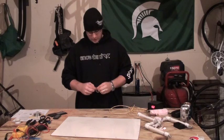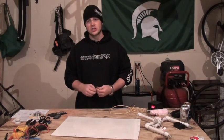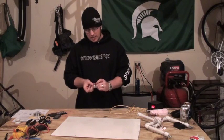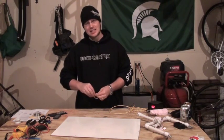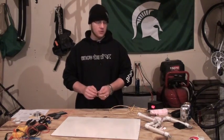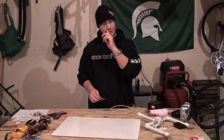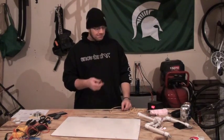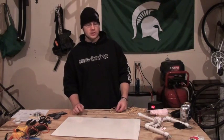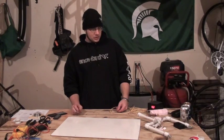If you don't want that big thing dangling, find some wire that's actually coated. Most of the coated stuff I found was like 18 or 19 gauge, which is going to be too big a diameter — you're not going to get much resistance at all. But it never hurts to try. If you still have your power supply clipping out, just put more length into your resistor and increase the ohms of your whole circuit, and you should get it to work pretty well.